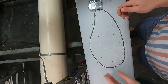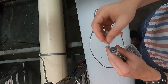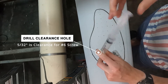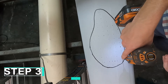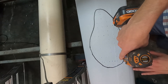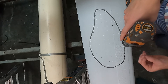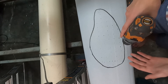Now that we have the holes mapped out, we need to start drilling through the first layer of fiberglass and the core. The hole should be large enough to fit the little tip of the syringe so we can inject the resin and get some good pressure behind it. You can actually feel when you get through the first layer of fiberglass, and then the bit just chews right through the core. Just let the drill do the work through the core and stop once you get through it.